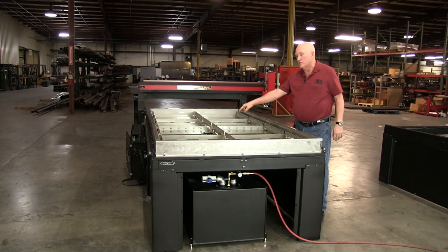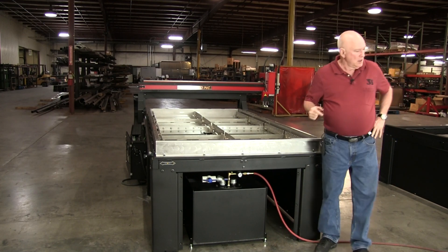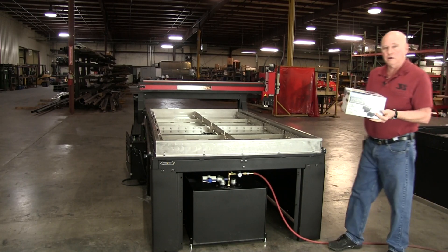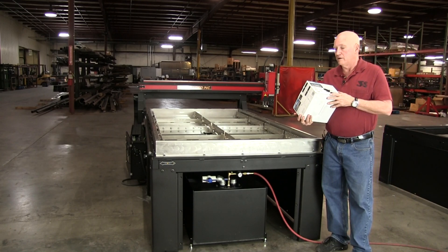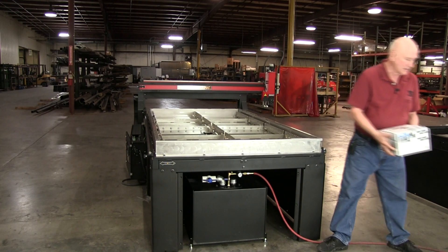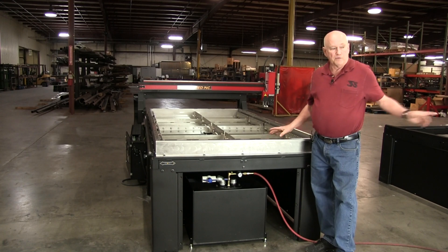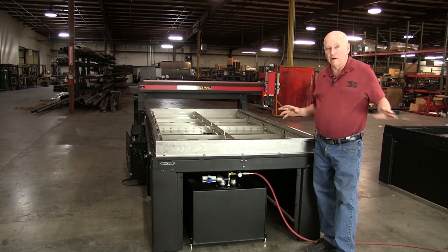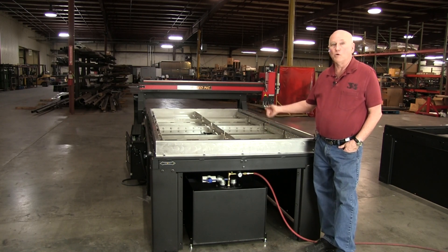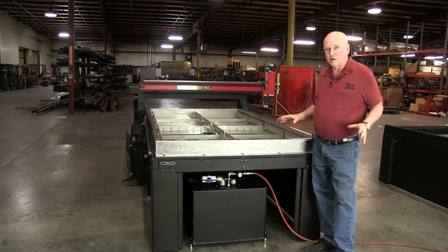I have no slats in this machine — I want you to see the water transferred up and down. There are other ways to get fluid in and out of a table. One of them is to use a transfer pump. I bought this one from Home Depot today for $98 — it'll move 360 gallons an hour. But this is a 4x8 tank that holds 103 gallons, so in the real world you're looking at just shy of 20 minutes to fill or drain the tank. This particular system will do it in one minute 40 seconds.